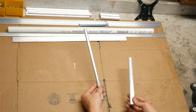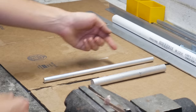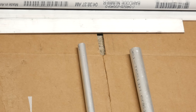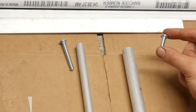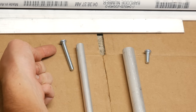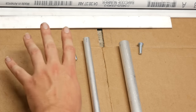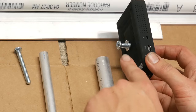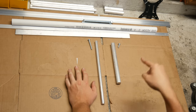We're going to start by making our housing spacers and receiver unit standoffs. The process for both is the same — we'll cut the dowel into short sections and drill all the way through. The housing spacers will be drilled for quarter-inch 20 two-inch long housing screws, and the three-quarter-inch dowel will be drilled for quarter-inch 20 three-quarter-inch long receiver mounting screws. The housing plates will be one and three-eighths inches apart, and we'll need around 12 spacers in that length, plus four in a shorter length of one and five-sixteenths of an inch to compensate for the aluminum angle that will mount our handle. The receiver standoffs will be cut to be half an inch tall.